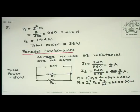So it turns out that the parallel combination, supposing these were bulbs, is particularly important when you use them in decorative lighting like Christmas lighting or Diwali lighting. We use several strands of wires which are in parallel combination, and within each strand the bulbs are placed in a series combination. As we have pointed out, within a strand, bulbs being in series combination, of course, reduces the effective brightness that a bulb could deliver, but the power expense becomes much less.